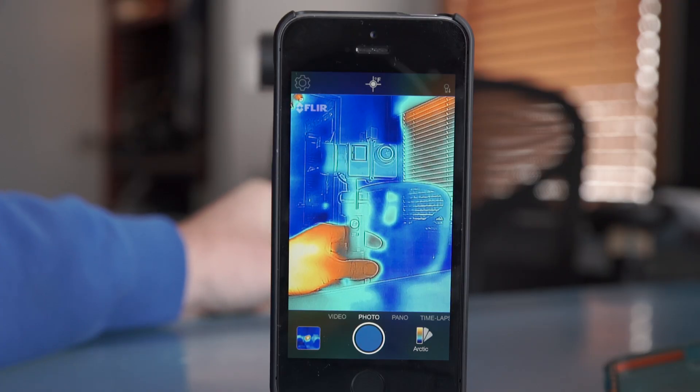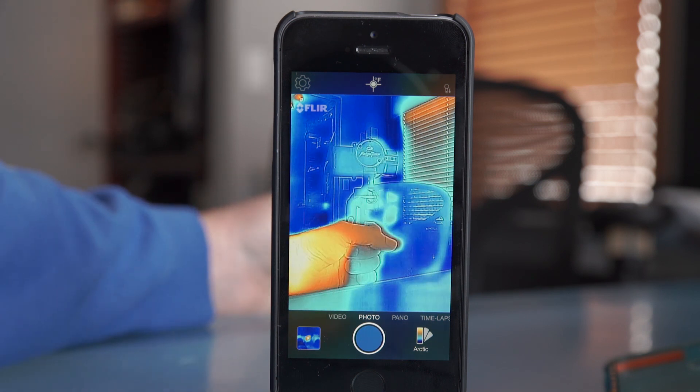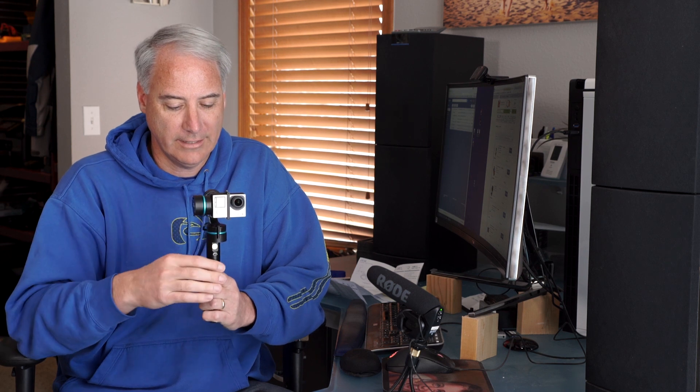I was reading somewhere that if you have a brushless gimbal like this one I'm reviewing, and the motors are working too hard — like if you didn't balance it correctly — they can get really hot. You don't want them to get over 80 degrees Celsius, which would be really hot, and it would deteriorate the life of the motors. But this one I was looking at doesn't have much of a payload and wasn't registering hardly anything at all. After a few minutes, they weren't getting hot — they never got warm to the touch.